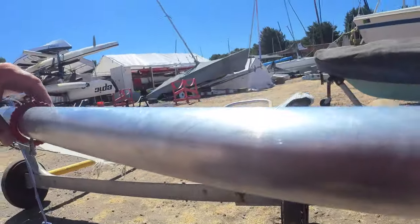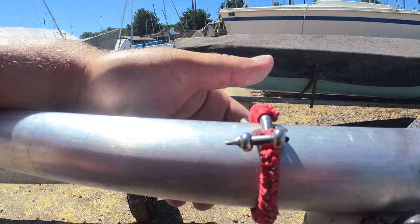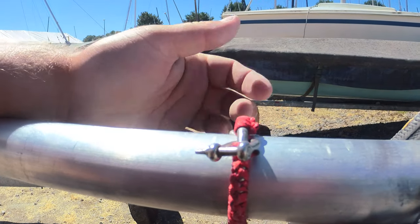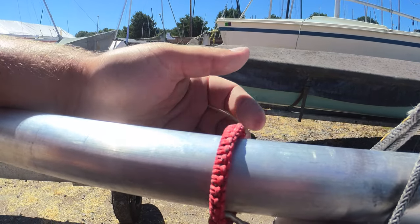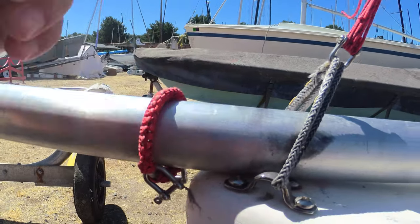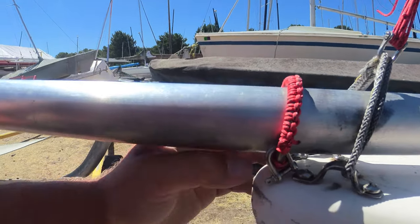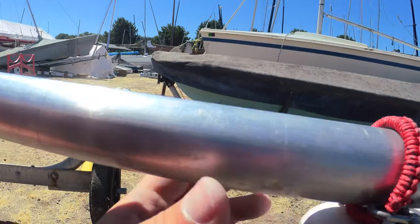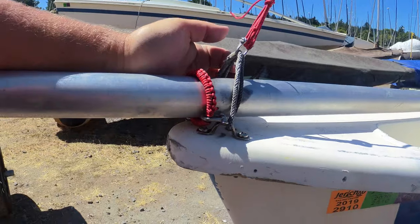Back onto the front - we slide our loop. This is a 2-inch by 3/16 stainless loop with some 2mm braid on there just to keep it from rattling. We're going to shackle it onto each pad eye - simple as that. This thing is rock solid and independent of the forestay.